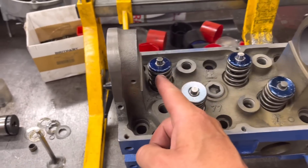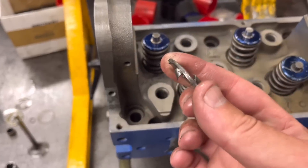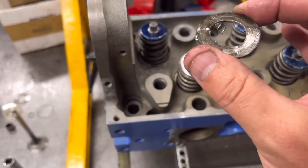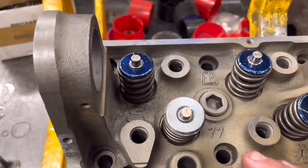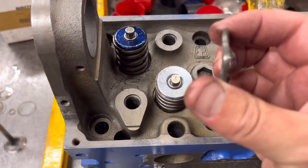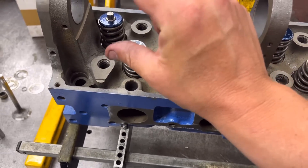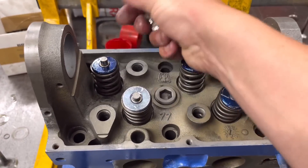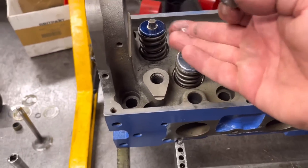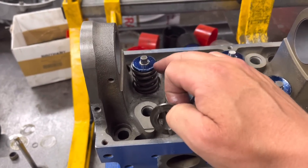The reason for that is because that was once upon a time pocketed, which brings the valve further through to get the initial tension on that spring. What someone had done is made a spacer out of steel and put that in the base here. To look at, you wouldn't have noticed — it looked just like the rest. It did sit a bit higher having looked at it twice, but you wouldn't have noticed. You'd have put this in there, but obviously I've got that out because it is two mil thick. So we were only running initially about nine and a half to ten mil of compression of that spring, which obviously is not enough — you're just going to coil bind on full lift and eventually it's going to shear off and cause all sorts of damage. So I've got that out, put my shim in there, got my valve height right, and they're all the same now. We've got about 13 mil of travel on that spring before it coil binds.